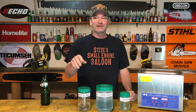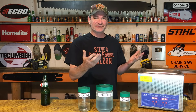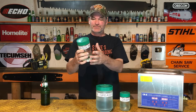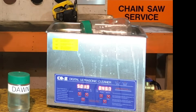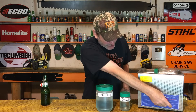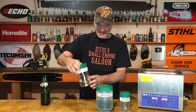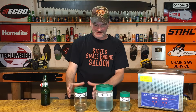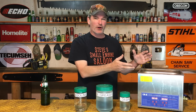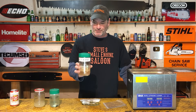Gasoline is my go-to cleaner in an ultrasonic cleaner, but I don't fill the whole tub up with gasoline. I take a container, put a part in there, screw the lid on, and put it right in the water-filled cleaner and let it float around. Those ultrasonic sound waves go right through the container — it's cleaning what's inside of it. It's contained, so you're not getting all that dirty solution into your water. There is nothing I've used that cleans oily, greasy parts and tools better than gasoline.